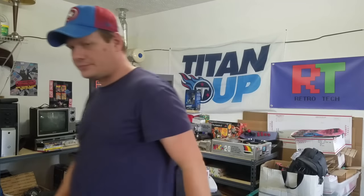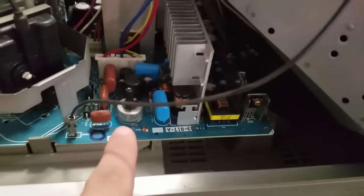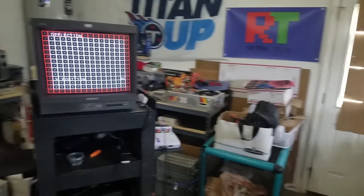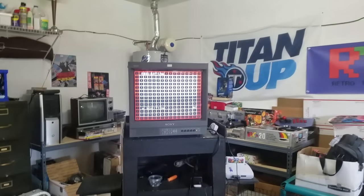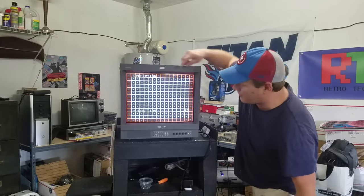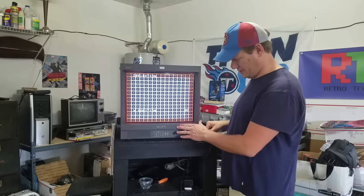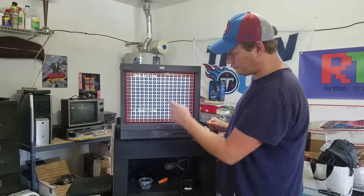I'm going to show you something around the back — there's a little potentiometer that we've been talking about. If you spin that, it'll actually center up your picture. If your screen starts to shake like that, that means you're getting too far out of the settings, and it's starting to mess with performance. You don't want any of that jumping around because you won't be able to fix it — it'd be hard to make any adjustments with the screen flickering. So keep it at 80, centered. That's the horizontal position setting.